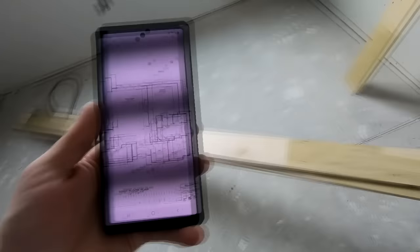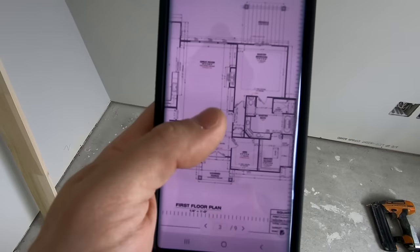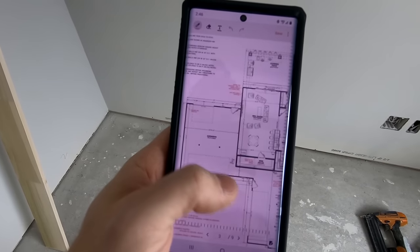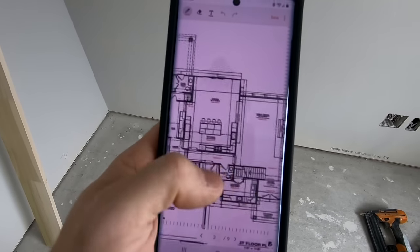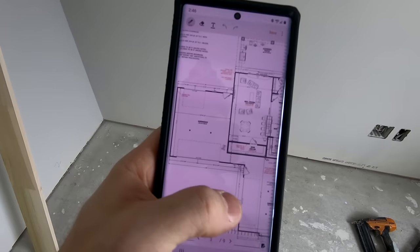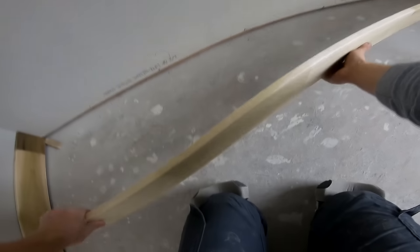In my area we install flooring after baseboard, so I have to reference the print and see what flooring goes in which rooms and keep the baseboard up at the proper height. For carpet it stays up three eighths of an inch, and for hard surface flooring I want to be one eighth inch above whatever the hard surface will be. I always rip some scrap spacer blocks out of scrap material on site and use those in the corners to keep the base up off the floor at the proper height.